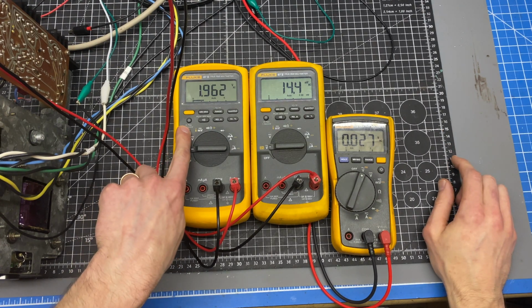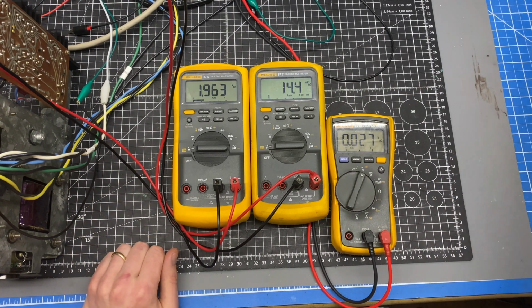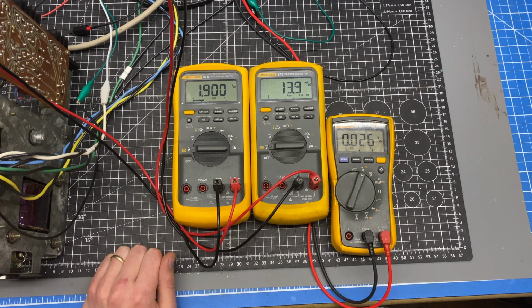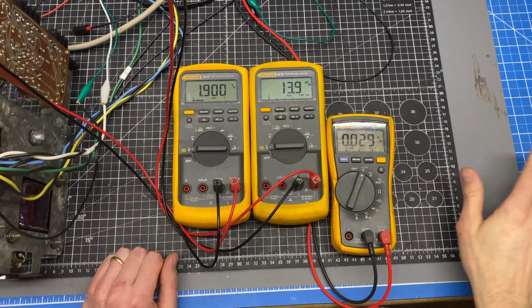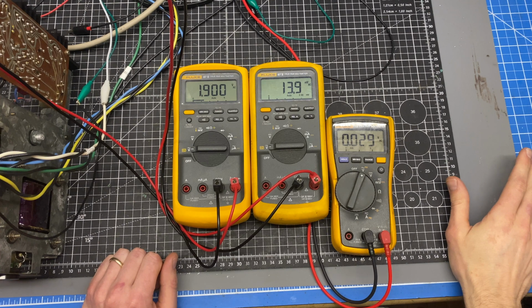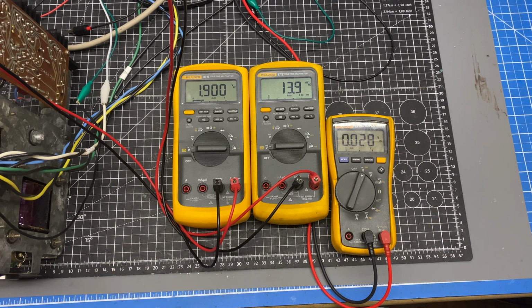So this is our tweeter, and see, we're close. With their recommended 100 millivolt test signal, I'm close but not quite. So I'm going to adjust this very slowly down until we hit 1.9. All right, so I'm at 1.9 volts now, and I'm at 96.9 millivolts. So just changing those capacitors and parts out was enough to correct that discrepancy in input voltage. This is testing very similar to my other rebuilt amplifiers so far, so that's a good sign.